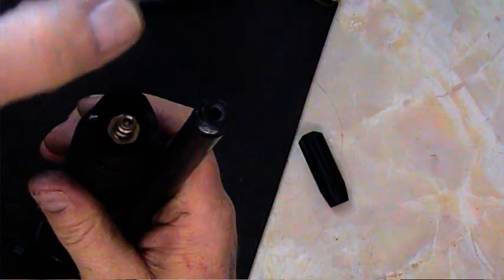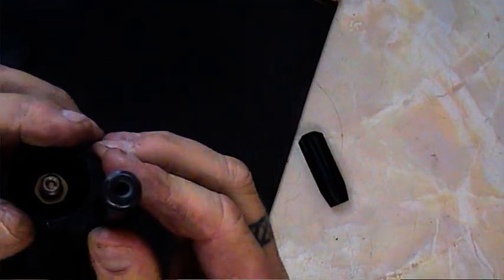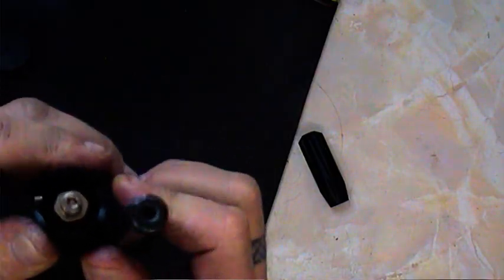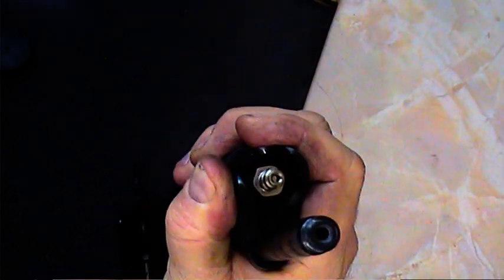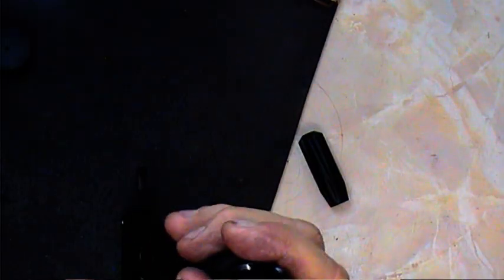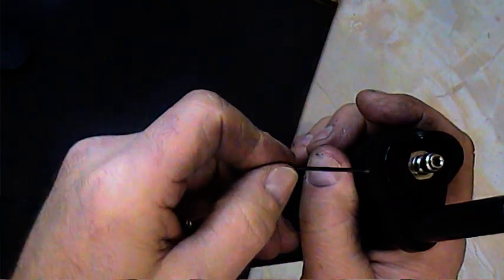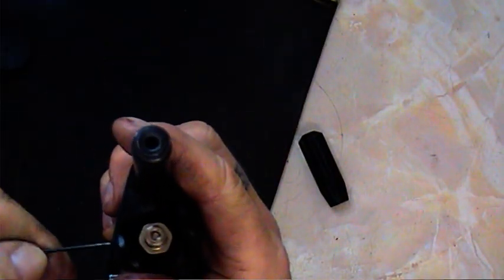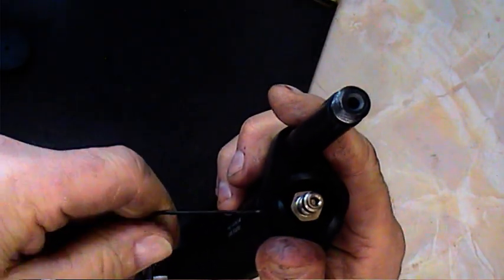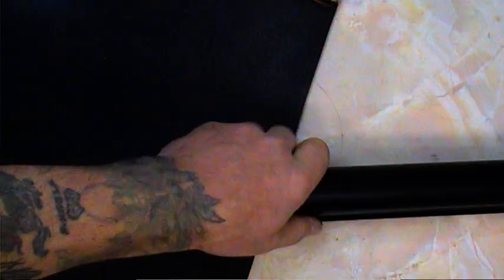What we do is put the barrel clamp, slide it onto the barrel first, gently manoeuvring it down until we get to the air tube. Slide it over the air tube O-ring till it meets its face, tight on the end, and then we can nip up the grub screws that we undid on the barrel clamp earlier. Again, they don't need to be wrenched up extremely tight, because all you're going to do is rip the threads out of it and cause yourself problems. Just a little pinch, that's all you need. End cap on, air stripper on. That's that section done.